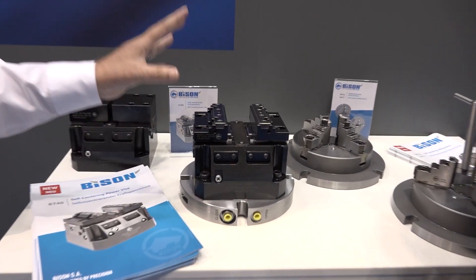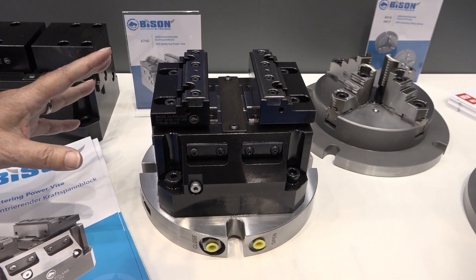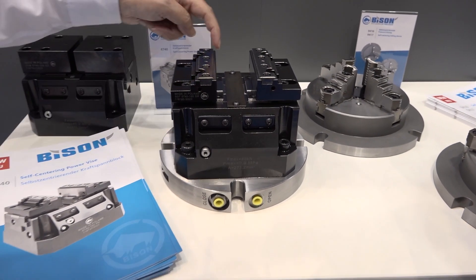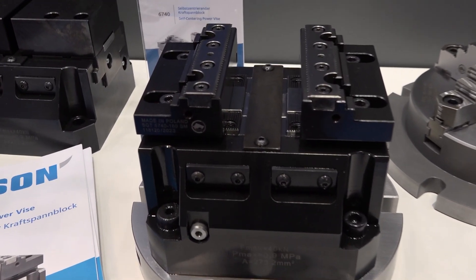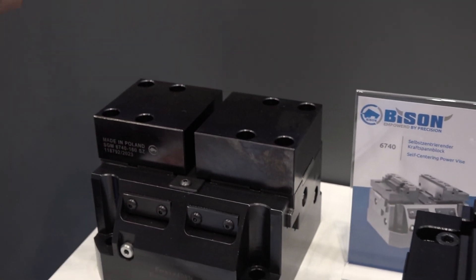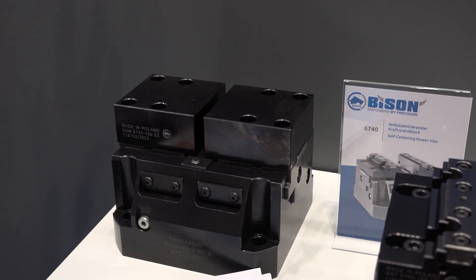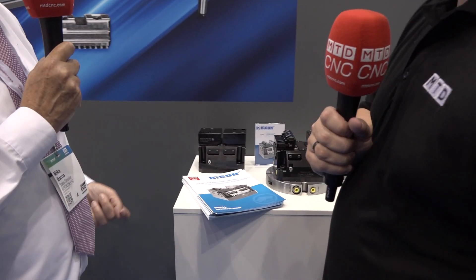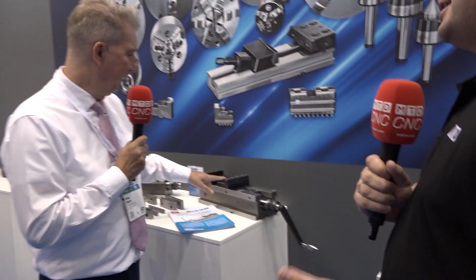This is another new one — 160mm wide, a stationary vice, pneumatically or hydraulically operated by a foot pedal. Look at the serrated jaws on here as well. Only three millimeters step, so less waste of material. Two versions — here's one with soft top jaws so the customer can machine that out to full enclosure of the product when machining. Sustainability is a big thing now, so wasting material is also becoming a big concern, and you're only taking three millimeters.